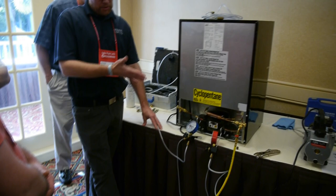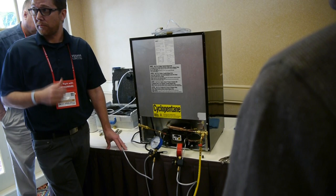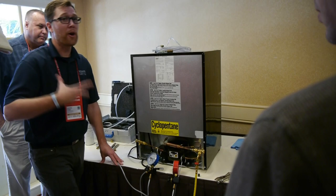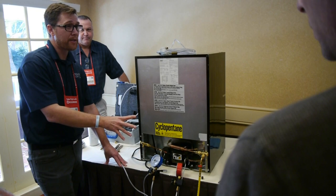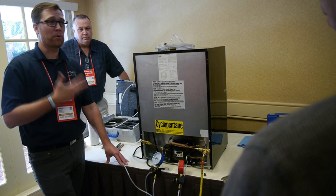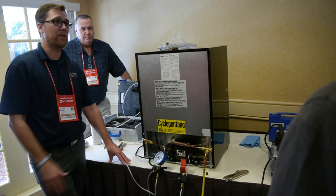When do you know you're done? When you keep doing this cycle on and off and you no longer hear any audible discharge — at that point you're done. Because this system has been running the entire lecture, the oil is warm and the compressor is pretty darn warm. That's helped break the bond and get the oil out. If the system was cold and hadn't been running, I'd be more likely to connect the low side to monitor pressure because I'd have more concern about refrigerant embedded in the oil.